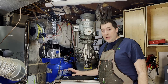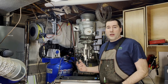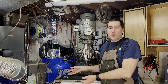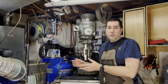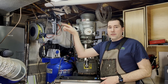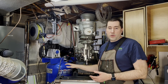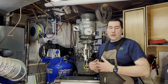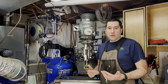The only problem is it's got a big tank and that takes quite a long time to fill if I were to leave it empty all the time. So what I first did when I got the air compressor is I put a ball valve on the exit and I could leave the tank full all the time and just close the valve when it wasn't in use. Behind me I've got a zigzag of copper tubing mostly to cool the air down as it's coming off. It also helps draw moisture out of it. There's a moisture trap down at the bottom.